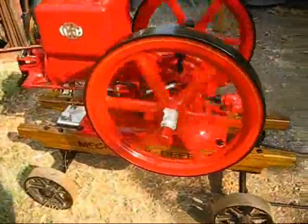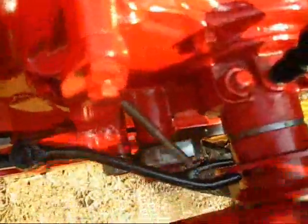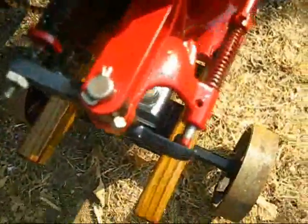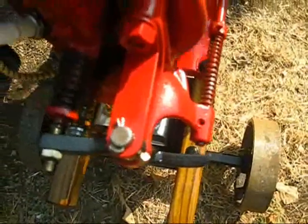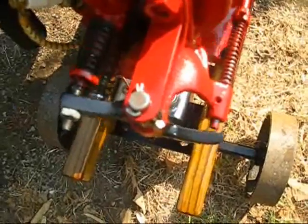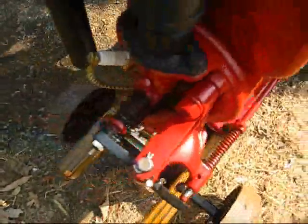As you can see, the engine is running counterclockwise — that is deceiving which way the engine is turning. It is running backwards. And as you can see the mechanism — it's simple hit and miss. As you can see the valve locks out, which is a sign of a true hit and miss engine. It only sucks gas when it releases the exhaust valve. There's that familiar hit and miss sound.